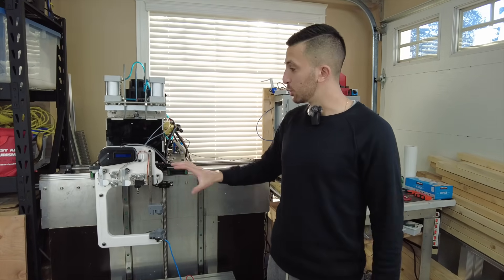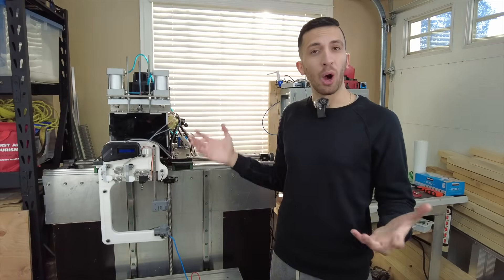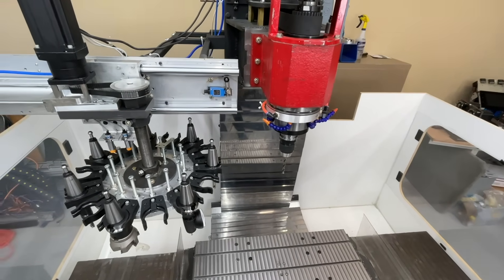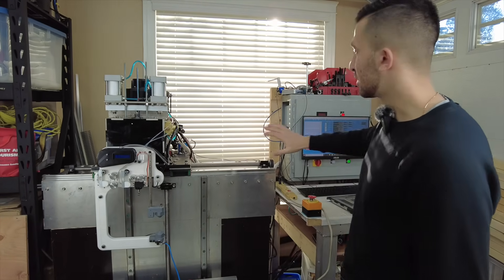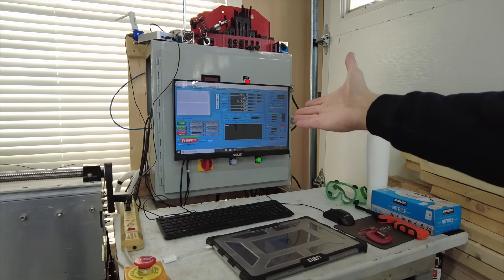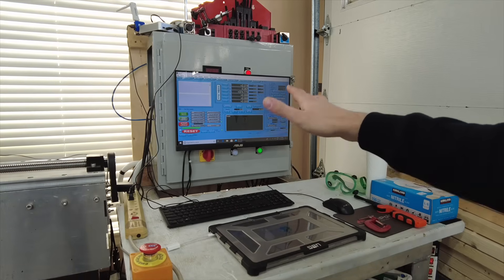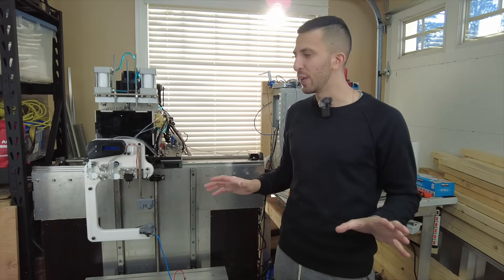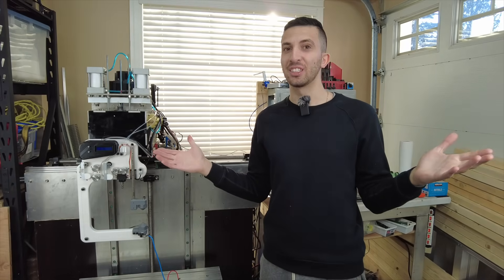Here's our little contraption which I've mounted on an old DIY CNC machine of mine. I'm going to be converting this machine into a wire EDM machine since I no longer need it — we built our massive DIY CNC machine as shown in one of our other videos. This machine runs Mach 3, and those familiar with Mach 3 would notice the display is a little different because I'm actually running a 5-axis custom version. Now that our contraption is mounted on a very accurate three-axis motion system, we're ready to bring in the deionized water and do our first test cutting some metal.